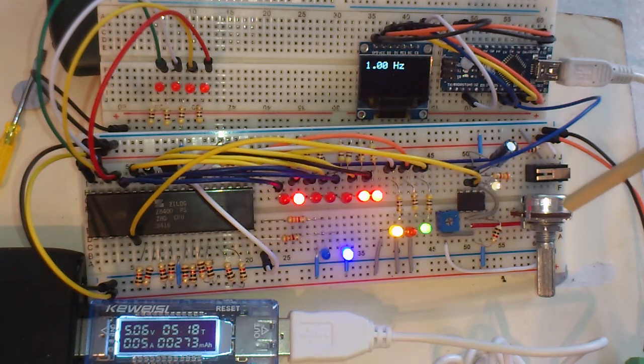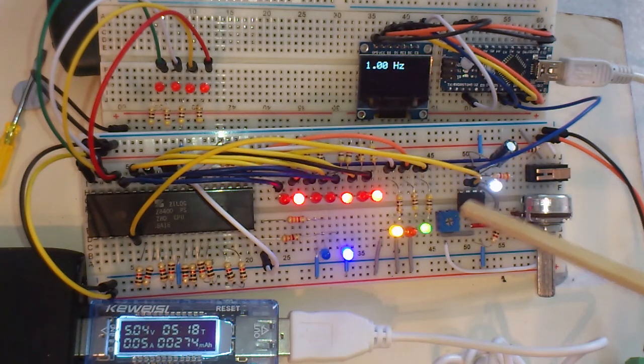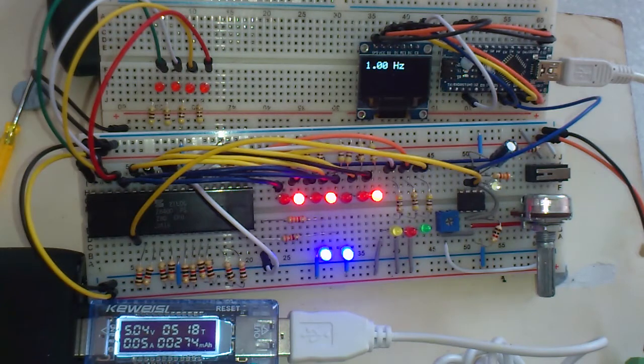So this is actually a mega ohm pot, and it's in series with a 50 kilo ohm pot. This is so I can have a coarse adjustment and a fine adjustment, and these go across pin 6 and 7. This is a very well known circuit anyway. You can look up the NE555 astable mode circuit. It's extremely common. I'll adjust the frequency in a bit just to show you it actually works. And I think that is everything about the circuit I need to talk about.